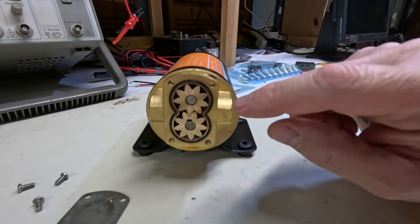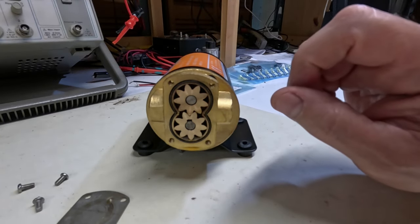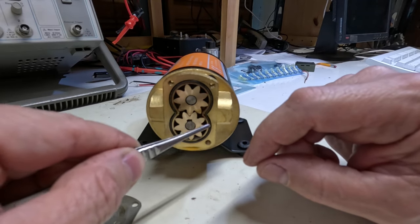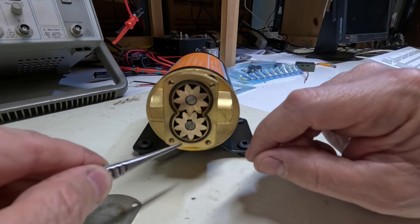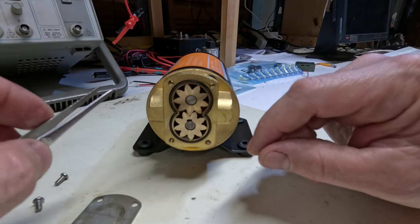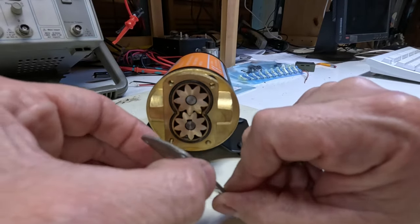The nature of this pump is that it's always going to operate. It's not going to stop unless something were to jam the gears. The biggest downside to this is this O-ring right here. Well, it's kind of a funky looking O-ring. Now, I don't know, maybe we can just do a standard O-ring. I'm not sure. I guess if I was smart, I would pull this O-ring out of here and measure it and get some spares. Anyway, that's how a gear pump looks, how it operates.